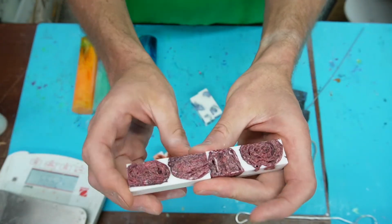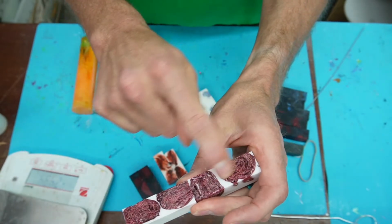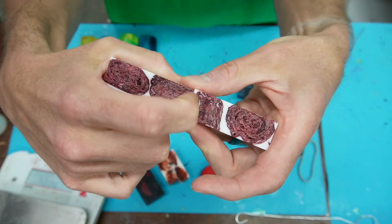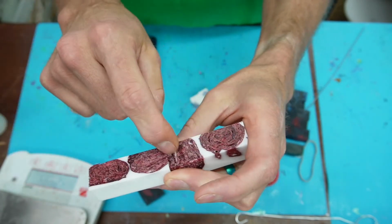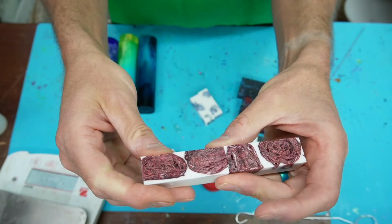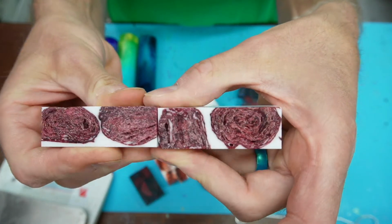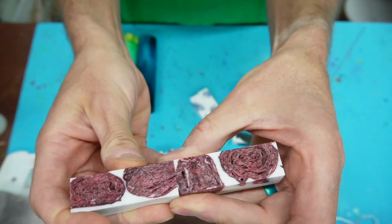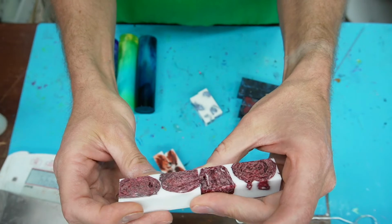This one was totally soaked up with cactus juice. Like it was heavily cactus juiced. But do you see all these little chunks? Because cactus juice is not like casting resin. It's a very thin liquid, and it really only hangs out in the fibers of your materials. So if there's a big area, it's not going to fill in. This just goes to show you what would happen with cactus juice. It's not a filler. It's not a gap filling resin. It just is going to harden the fibers, the cellular structure of materials.